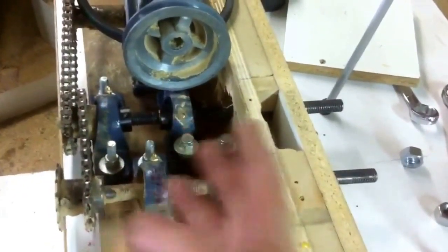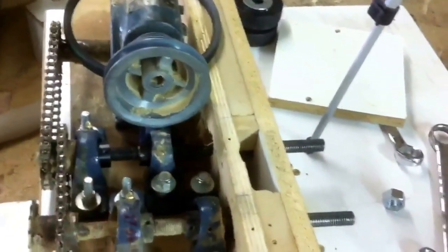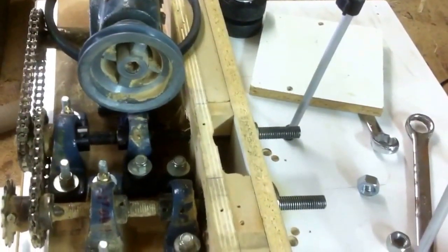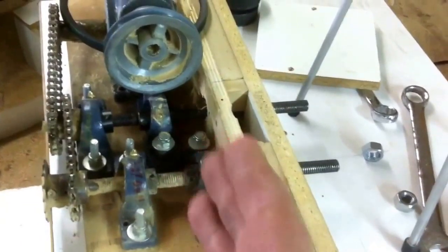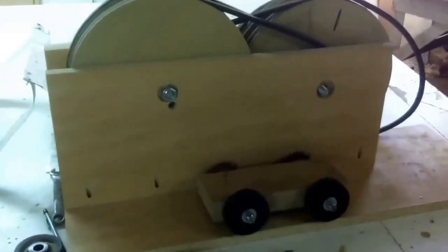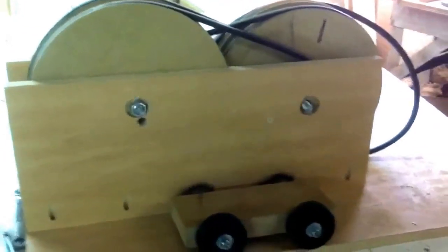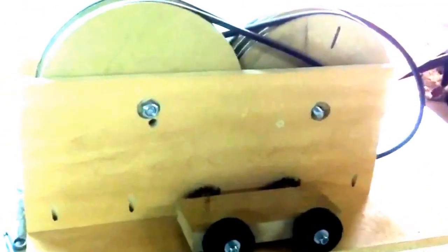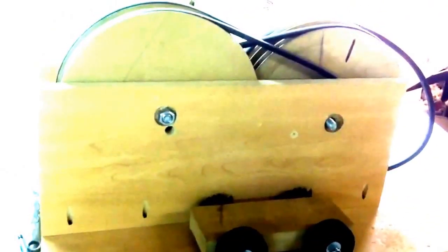It's a pretty straightforward rig, but like I said it runs into pretty big costs. You're going to have four pillar block bearings, which aren't cheap, and a gearbox — if you find one for 200 bucks you're doing pretty good. Then there's a bunch of little pulleys, sprockets, and bolts, so this machine could potentially cost over 200 dollars. But I've got another way I'm working on — you've seen it. We're going to have hockey pucks on the shafts the same way, but with a wooden gearbox. Check out my wooden speed reducer video — it only cost about 20 bucks in belts so far. I'm trying to come up with a way that's even simpler to build and does the exact same thing. You guys keep tuning in — hopefully you like my videos, and I thank you for watching.